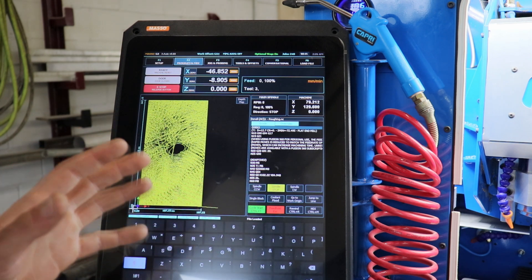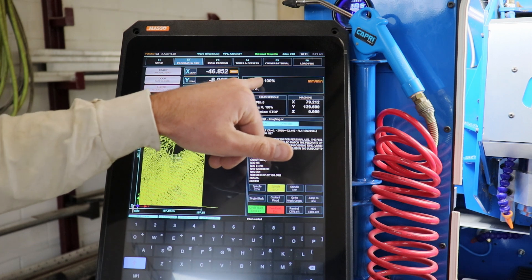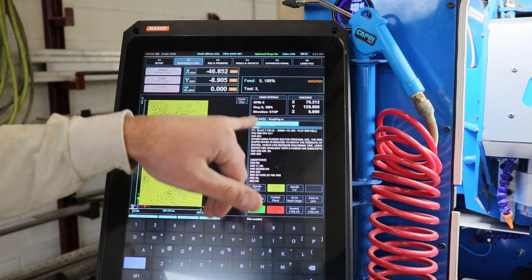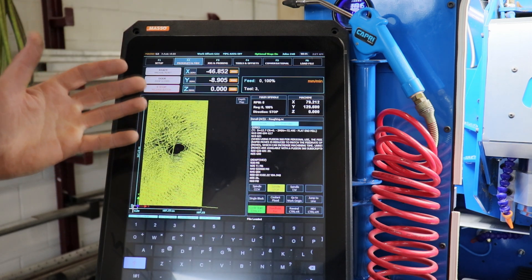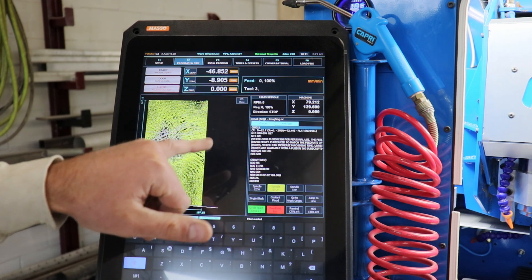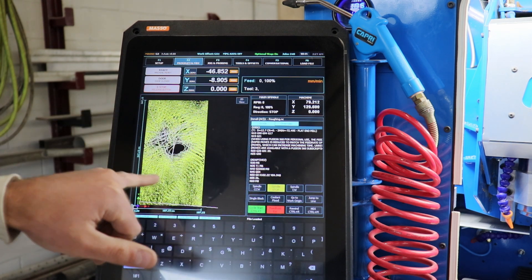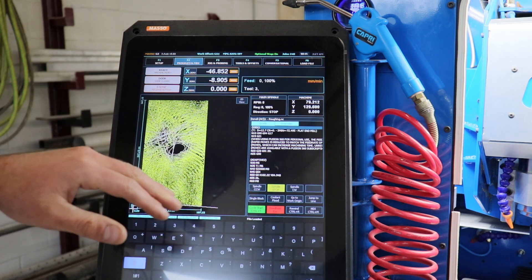It's very simple — similar in a lot of ways to Mach 3, just much more refined. As it's running it'll tell you the current feed rate, the current tool it's running, and how fast your spindle is moving. The graphic over here has an option for a depth map, which will show you what these lines look like as they refer to the Z-axis travel — sort of a topographical surface.